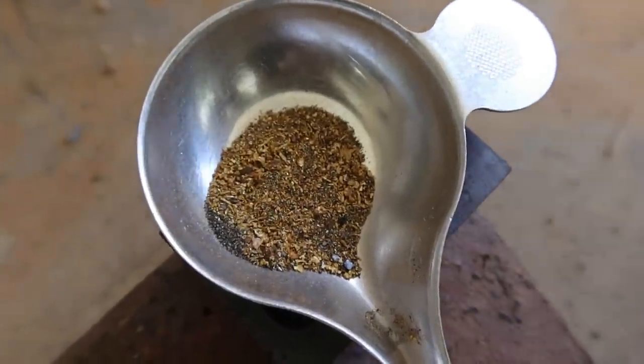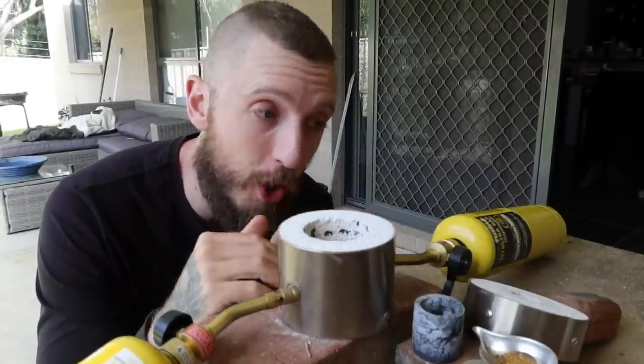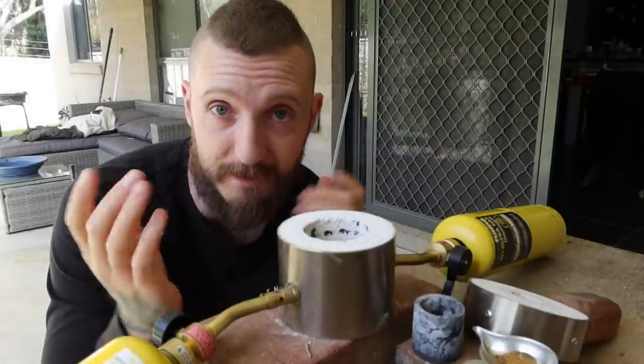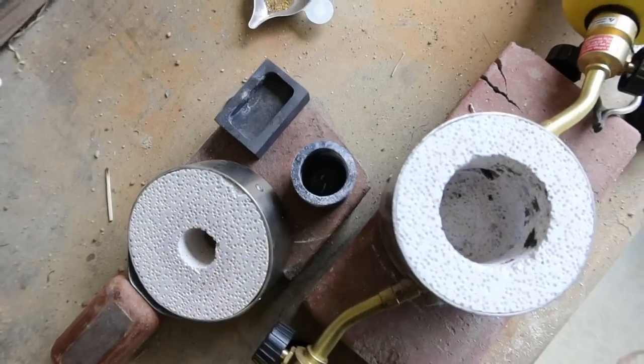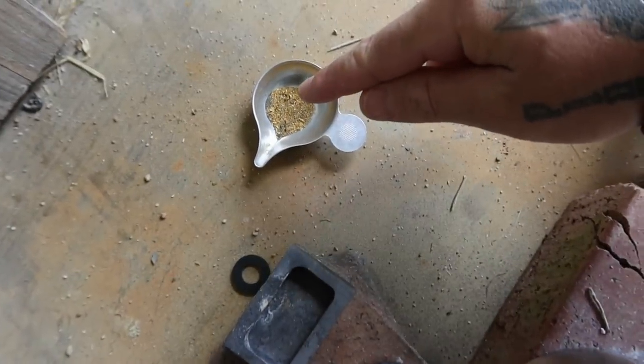Remember those bits of silver sulfides I was talking about? That's where this comes in - it's called fluff flux. It does a couple of different things in your smelt depending on the mixture. If you have an oxidizer in your flux it'll help get rid of those sulfides and collect other impurities out of your gold, so this is a very basic step in refining your gold to being 99.9% pure. I must say I am learning to do this and I am going to make mistakes. This is our first really big smelt, so if you have any tips please leave them in the comments. Things I already know I'm doing wrong: this is a really big crucible, that's a really big mold, and that is not enough gold to fill all that up.